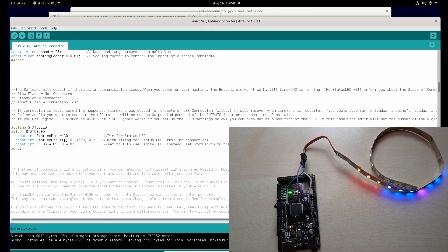To drive an optical warning that something is wrong, there is another function. In the Arduino software there is a part called status LED, pre-configured to be enabled. This function lets you define an LED that gives you a signal if the connection is established, or blinks if there is an issue. You can see the Arduino is blinking all the time because it has no connection and is waiting for one.